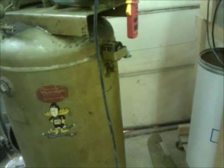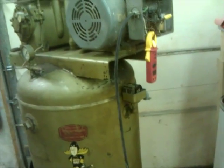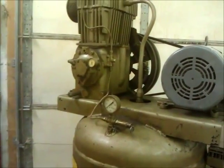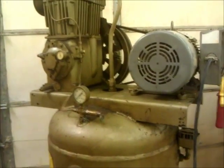I'm going to leave enough air movement for the motor, and I also need to replace the pressure switch. This one's probably set up for 150 to 175 pounds, but I don't need all that high pressure — I'm after the volume. So I'll replace the pressure switch, which is probably a good idea in general. I did run it up a little bit and it worked pretty well, actually.